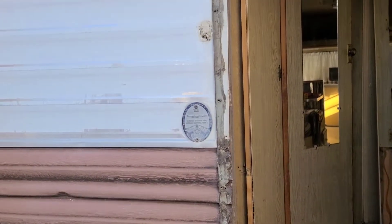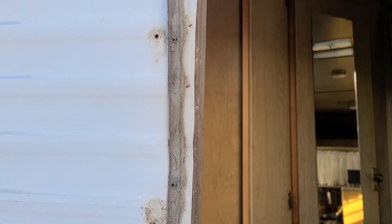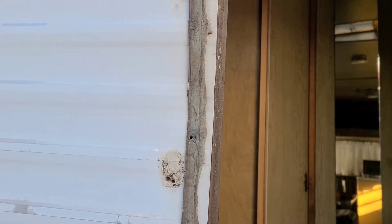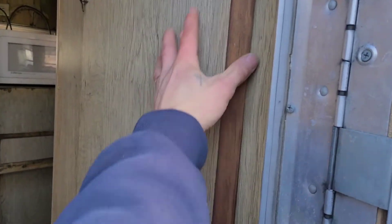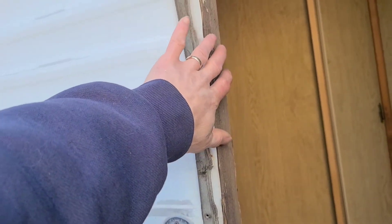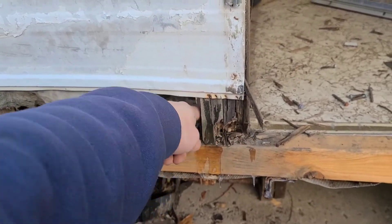I'm back at it again today. I decided to get a little more detailed with the reconstruction of this wall. There's always so much pressure on this wall — people are using the handle to pull themselves up. After a while I started thinking about how important this one stud is. This side is really secure, probably partly because of the framework of this closet area. But this one was in okay condition up toward the top, but it's just so rotted down here that I figured I might as well just replace the whole thing.